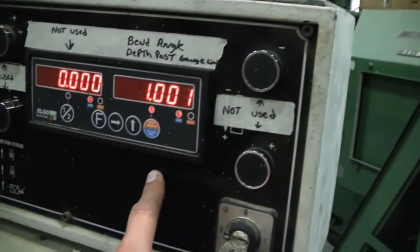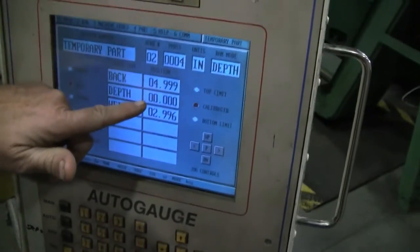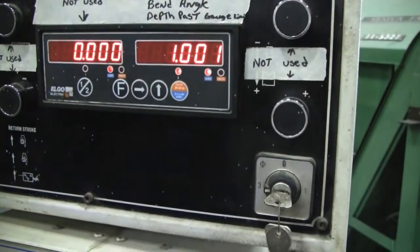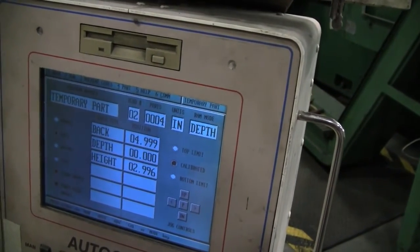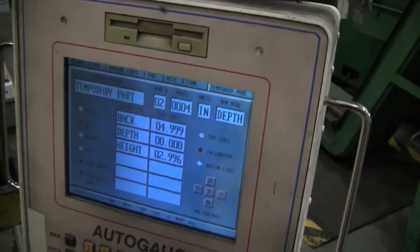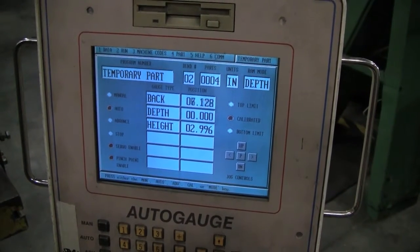This is rammed up here. There are two ram depths. The initial ram depth is at zero here, but set to one inch — measured from my zero point at the top of the sheet metal going down one inch. An additional ram depth on my second or first bend will go down another hundred thousandths on the next bend.